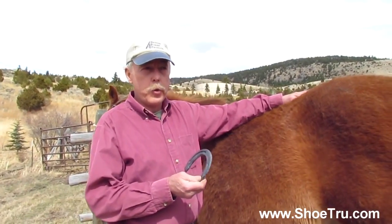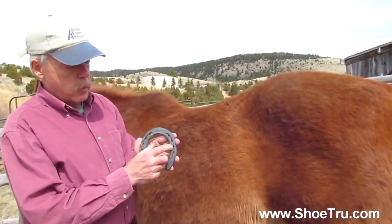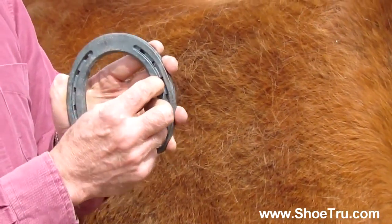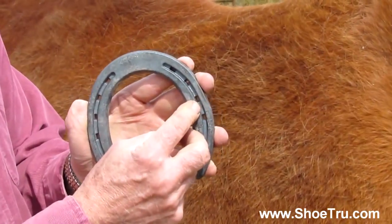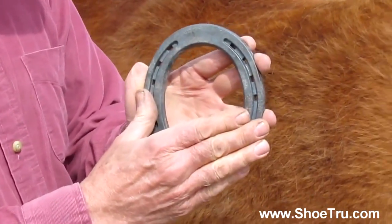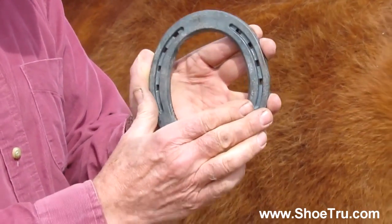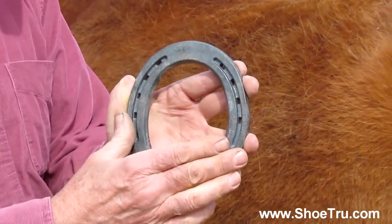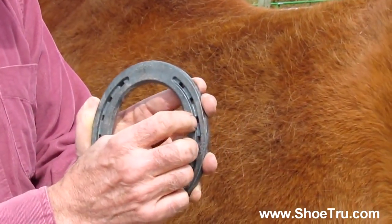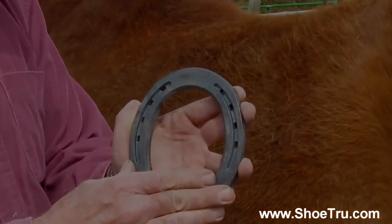Here's a little trick that might help if you're having problems with shoe alignment. The nail hole is about a quarter inch in length. If you take the point of the nail and start it at the very bottom of that hole, as you hammer the nail in it's going to pull your shoe down an eighth of an inch. If you put it in at the top, it's going to push it up an eighth of an inch. To keep the shoe exactly where you want it, get the point of your nail in the center of that hole and hammer it in — your shoe will stay right where it's supposed to be.